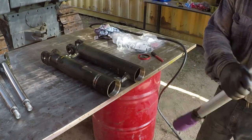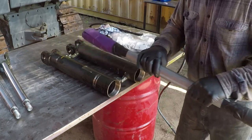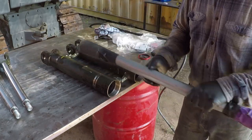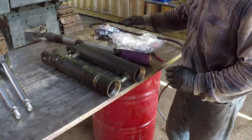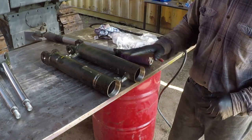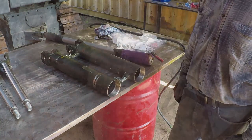And then I polished it with the 220 grit sandpaper all the way. And then I finished it with the 2000. I spent more time with the 2000 until I got smooth and mirror finish inside. Then I cleaned it again with diesel, blew it with air, sprayed it with carburetor cleaner, blew it with air. They're clean and dry, and now I'm ready to assemble everything.